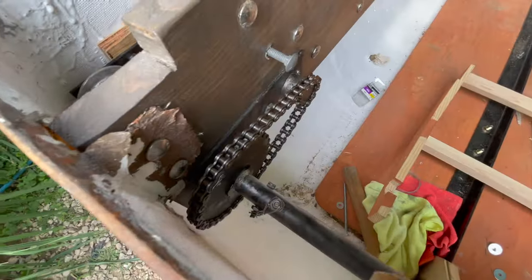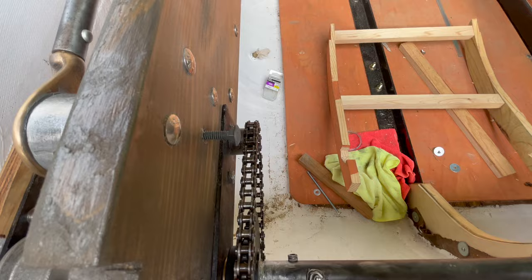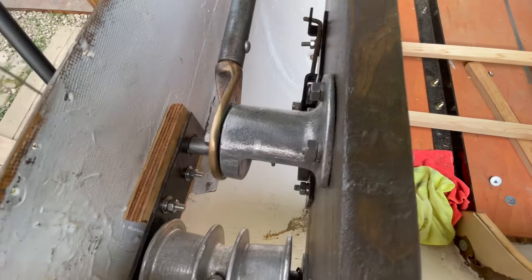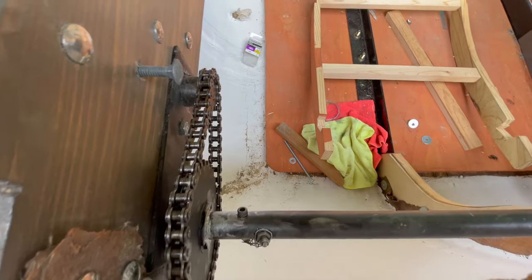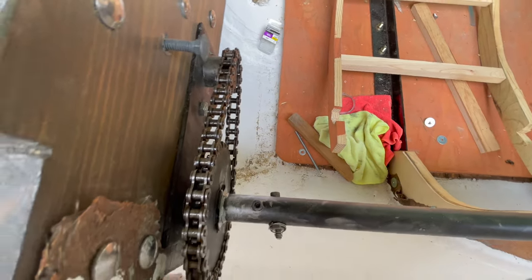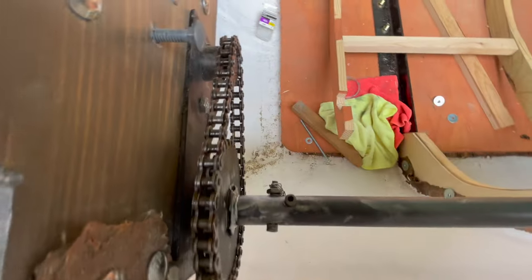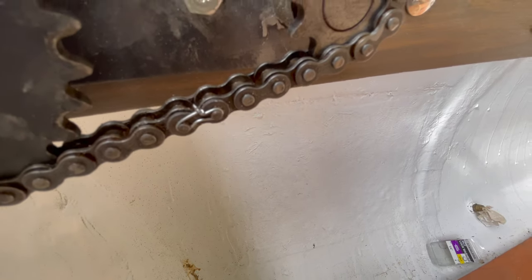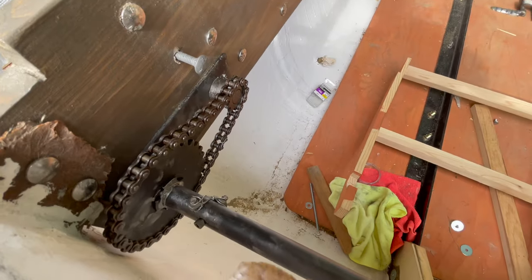So as you crank the trailer up, you can see that brake is letting go. But if I go backwards to crank the trailer down, the brake locks. However, the arm to release that is broken — it would come out right here. I'm going to try and fix it with a little bit bigger piece of steel. That's a dinky little thing — it's no wonder that broke. There were press-fit brass bushings. I have gone with a spring against a washer just to keep this in place and keep it from moving back and forth. It can't touch on either side because it has to spool freely. I've got this all back together, and when you crank to raise it up, it's working pretty smooth. I did lose the keeper on my chain — I had to go with a safety wire on it.